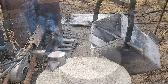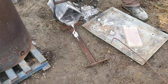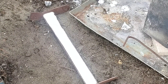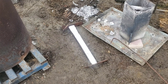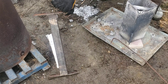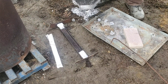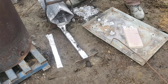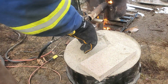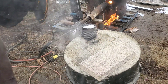We've got a crucible full of aluminum and I'm not going to do any more pours today, so I'm turning this aluminum into ingots. This mold has already been preheated, so it's already hot. I'm tapping the aluminum and you can actually see it jiggle in the middle — you might want to scroll back and have a quick look at that. Once it stops jiggling I can roll it over and knock it out of the mold. I'll just remelt everything. Now let's head back over to the mold and see how it made out.